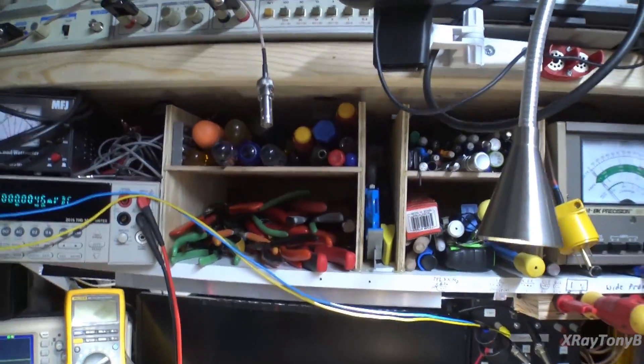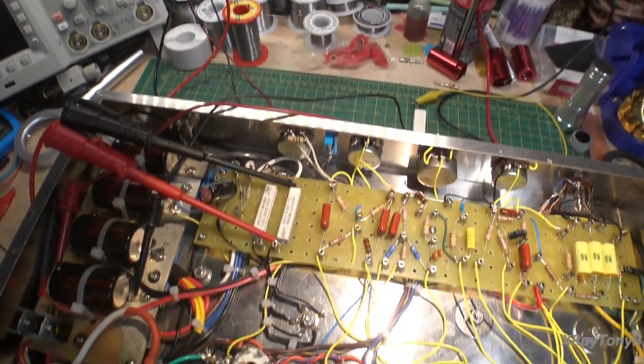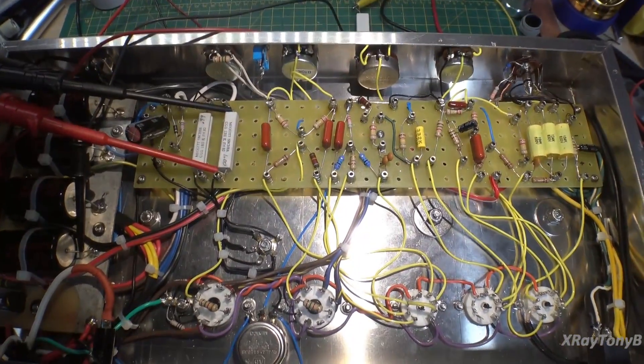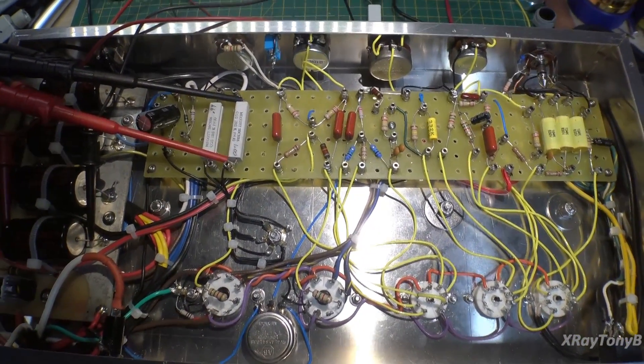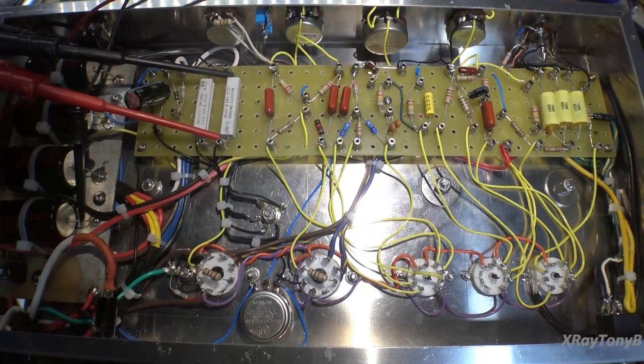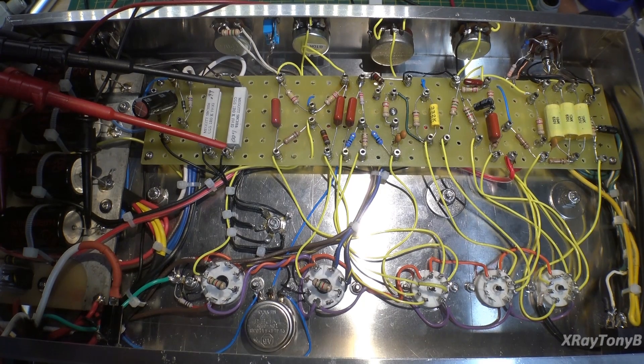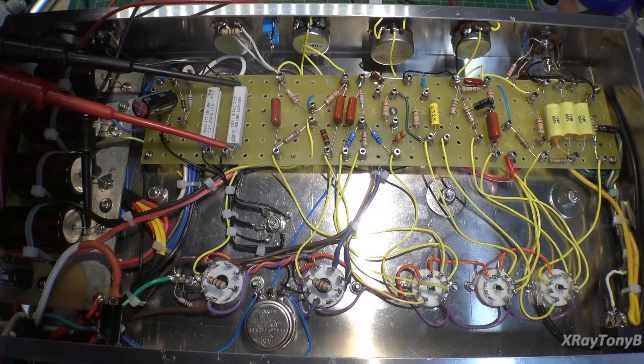Let's put some power on this. There's not much to see, but I'll point the camera here just in case there's smoke — though I don't think there will be. I have my dim bulb in there, so that should protect things. Let me get this meter turned on. I'll dictate what I'm seeing on my meters when I flip the switch. So I'm on limit, dim bulb, turning it on — the bulb flashed and now it dimmed down.